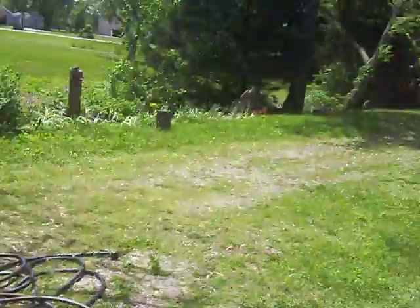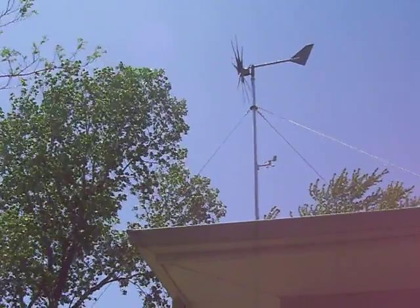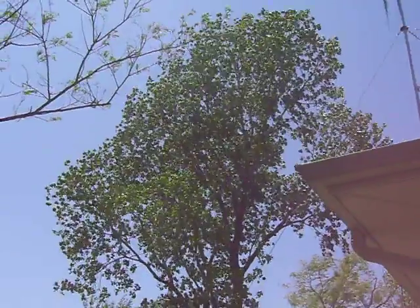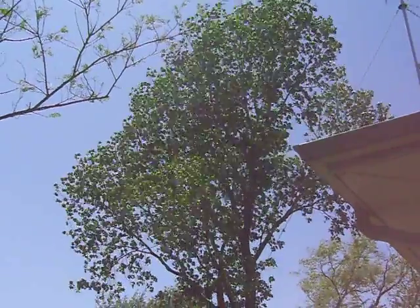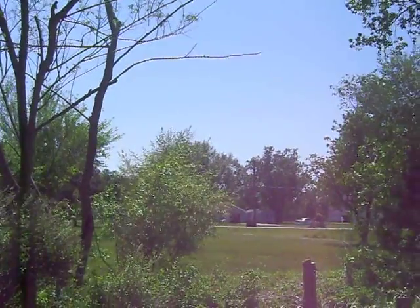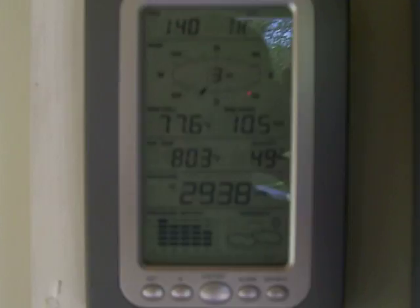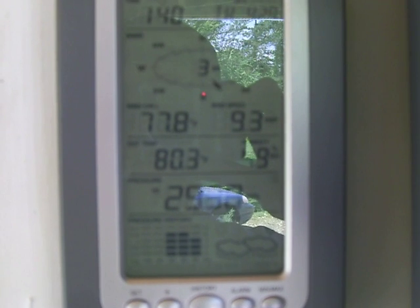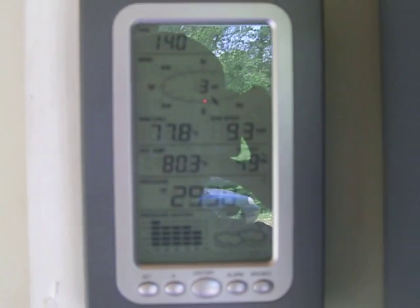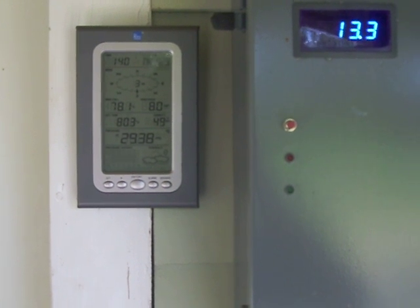It's nice and stable. It's a small wind today but it's held tight. My problem is this cottonwood tree is killing me when I get the southwest wind — it's a 70 foot tree. Other than that it's pretty wide open for a good 300 to 400 feet. We're getting about a 10 mile per hour wind — it only calibrates every couple seconds — 9.3. I've found that the turbine doesn't even spin until 8 to 9 miles per hour, and I don't create any amperage until 11 miles per hour.